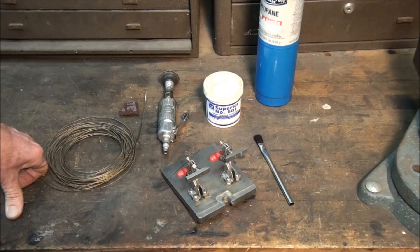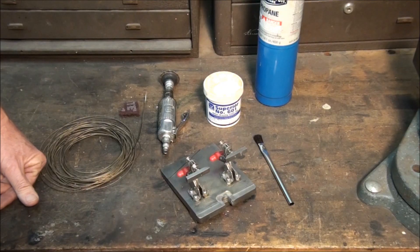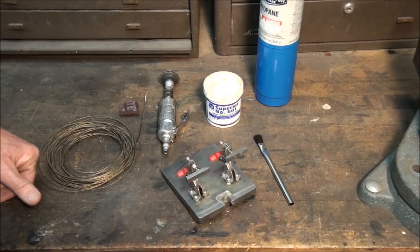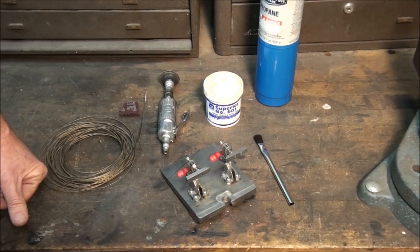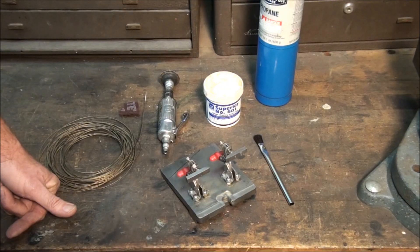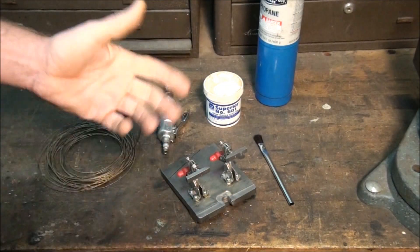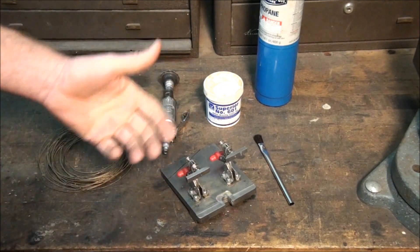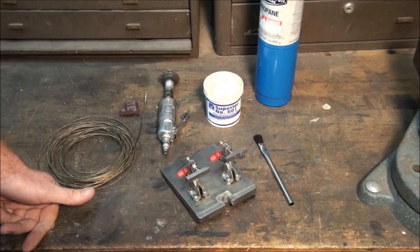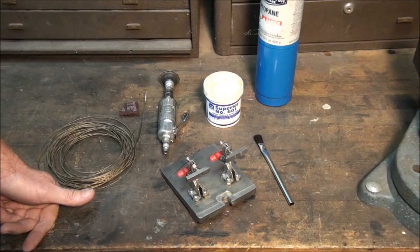There is an alternative way of making your own blades that doesn't require a welder — it's called silver soldering or silver brazing. I've been doing this for quite a while and it works great; in fact I haven't had one break yet. I can't say that about welded blades — I've had plenty of those break. It takes about the same effort and time, but doesn't require specialized tooling. You don't need an expensive welder; even a simple bandsaw blade welder runs at least $600.